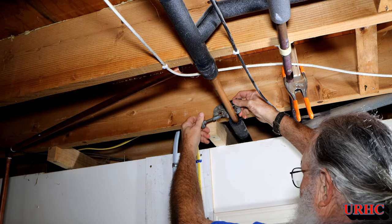I did put a drain pan down there but really don't need it in my basement. Here are the costs: the old propane water heater cost about $923.15 a year — $17.75 a week. The new heat pump water heater used 9.49 kilowatt hours in its first week, which was $1.52 worth of electricity. So it looks like we're going to save about $16 a week if this continues, and it should pay for itself after about two years.